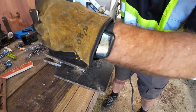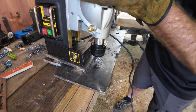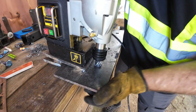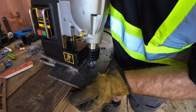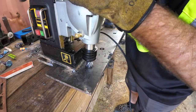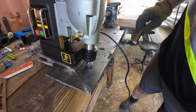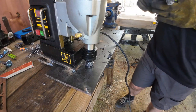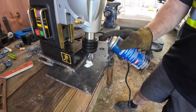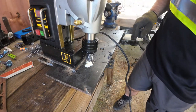There, you got to see what happens. It's a super, super slow process. Of course, having a drill press solves that problem, but I don't have one, so here we are. Get a little more support. That happened on the other cuts too. So I know if I just back up, get some lube in there, once that bit is touching on all sides, then it'll cut as normal.